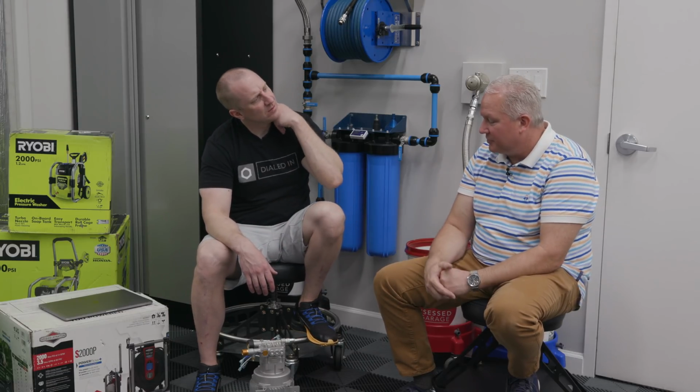That's why you didn't really see any pressure drop. I would have thought that going to a larger internal diameter hose, a lot of these pumps would have a hard time with that, and they typically don't. No, they'd have a hard time maintaining pressure through that bigger supply line. I guess it's because the nozzle, the orifice, dictates everything. It's right, and that and the resistance, right?